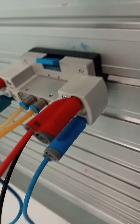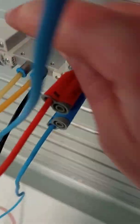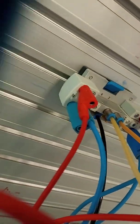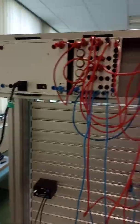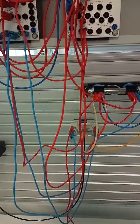We have solenoids here — inspect the directional control valve, solenoid here and solenoid here. No corrosion, in acceptable condition, cables in good condition. Our pipework seems secure. In general, before running the system, the initial inspection shows everything looks in reasonably good shape.